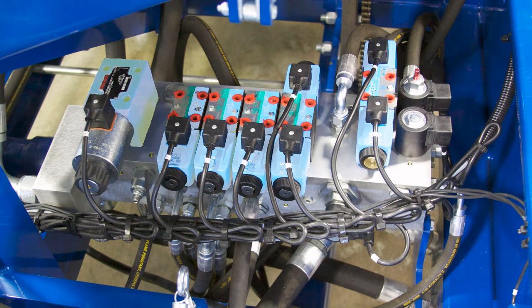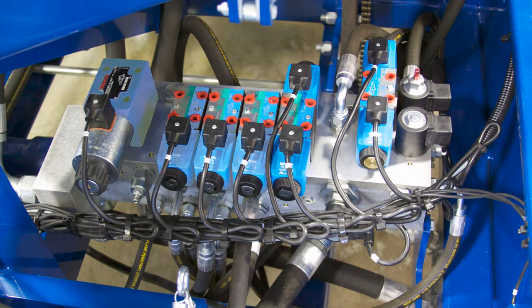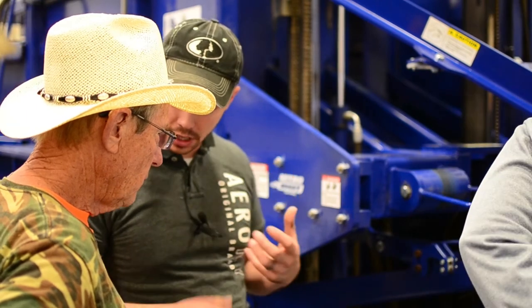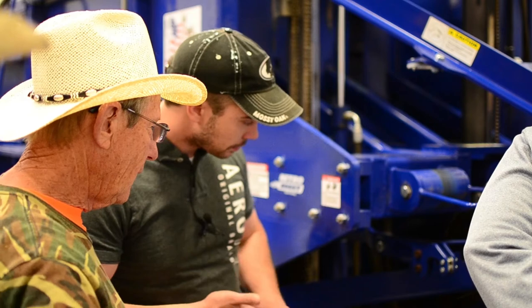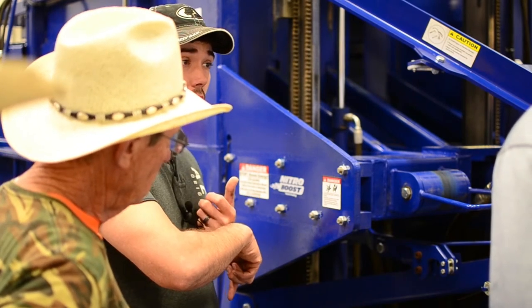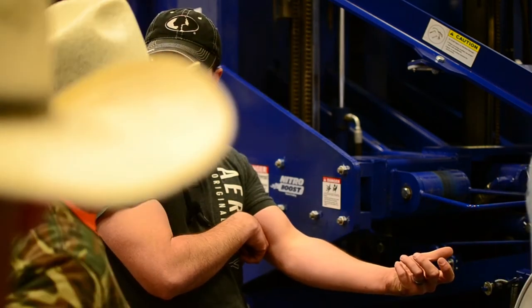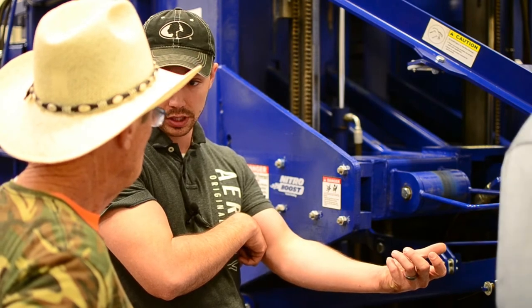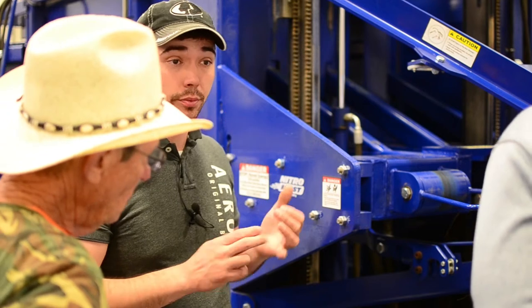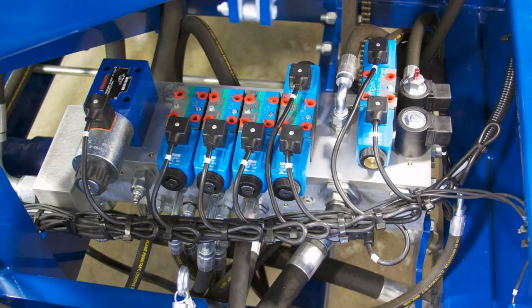Some directional valves are two-position and some are three-position. Any of them with one plug is a two-directional valve - spring brings it one way, the coil brings it the other way. Whenever a coil is energized, it magnetizes, pulls that valve one direction, and allows oil to flow through one port. As soon as the electric goes off, it goes the other direction from the spring. For motors you'll have the three-way valve - one direction, back direction, and a center point where the spring isolates it. One plug means it goes either one way or the other. Over there you can see one with two plugs.